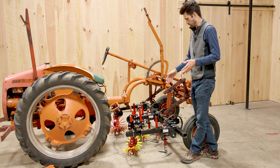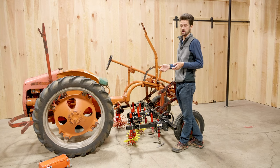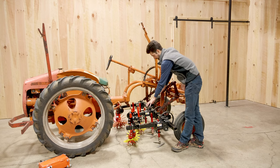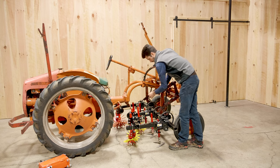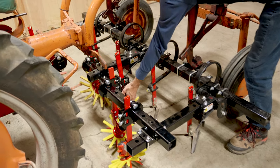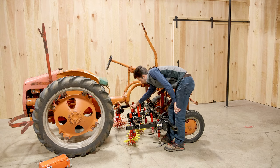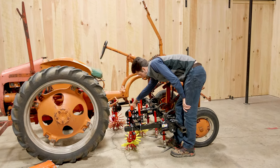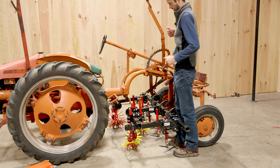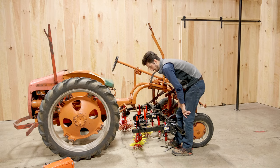I've only got three 9-inch fingers on this side and three 13s on the other, but you get the idea. We're set up for three 15-inch row centers. If you're going wider, you've got more space. If you're going narrower — say 12-inch row centers — you'll definitely need the extension. For 15-inch row centers with 9-inch fingers, the middle row works pretty well. One thing to keep in mind: the torsion bar, depending on where the toolbar is lifted, can catch this piece right in the middle. That's an easy fix — you can just torch or grind off that end a little bit if needed.